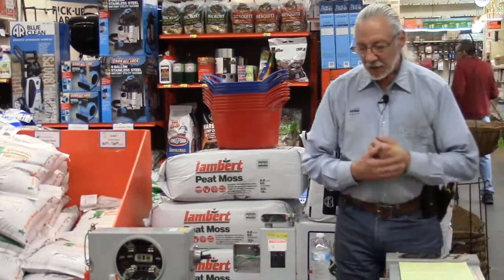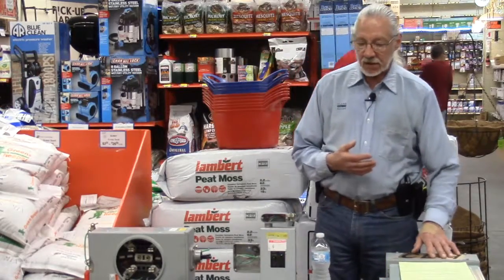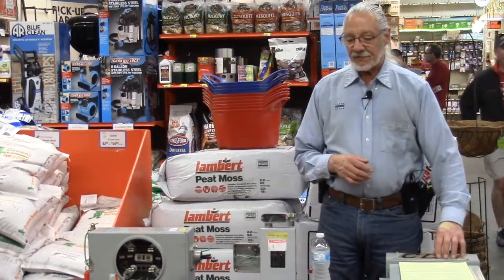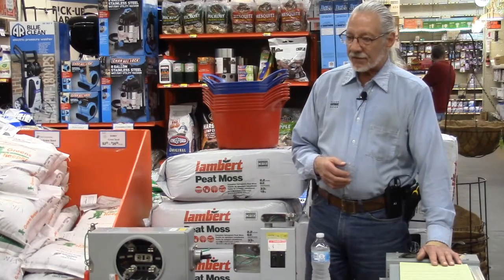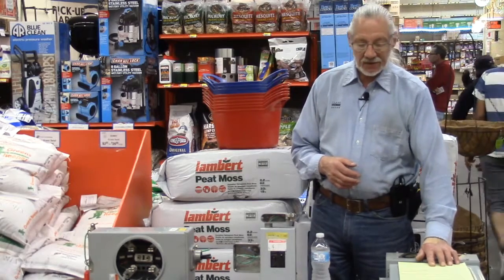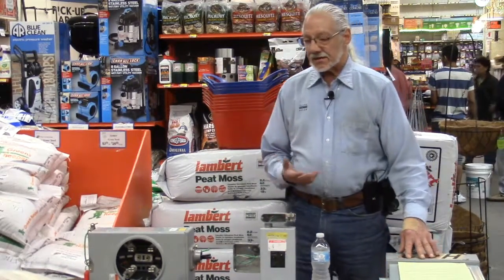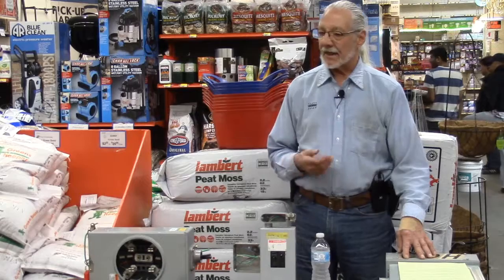What is, in fact, your wish list of the new circuitry compared to what you have now? Is it just to modernize the equipment and you're going to keep the same thing? That's fine. If, in fact, you're adding circuits, it's a lot more involved than just changing the panel box. Obviously, when you start, you're going to have existing wiring in there that is going to have to be put into the new box. But if you're going to be adding new circuits, that means you're going to be actually fishing walls, adding conduit, adding wire, and adding circuits.